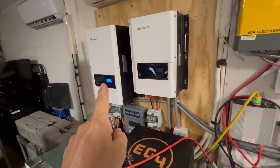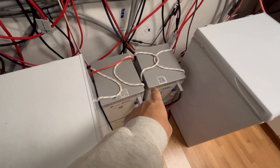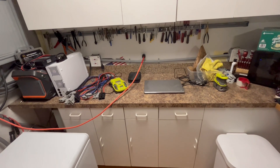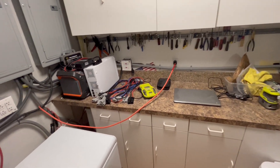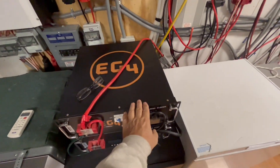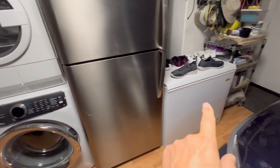Like I said, that's a 48-volt inverter going to the three batteries down here, and this is a 12-volt inverter going to these 12-volt batteries all in parallel. The one over there at the patio pool door wall is running right now. If we wanted to, we could plug it into this other 48-volt system that's currently using these two batteries. So we run a freezer, another freezer, a refrigerator, a freezer combo, and another freezer over here.